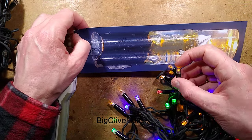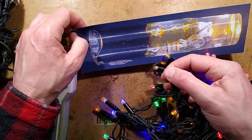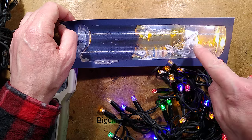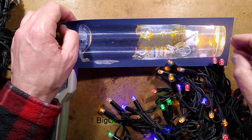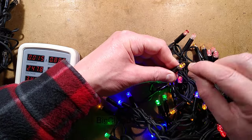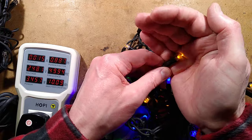In the early days they just had a domed cap, and the LEDs were standard domestic LEDs with the concave lens in the end that splatters light out in all directions. There was a problem with the curved dome — when they potted it, it caught a little bubble of air, and the light tended to shine out the end, making it very directional. With these newer ones, the plastic cup has a slightly concave lens so that even when you plunge the LED into the resin it still gives a wide-angle effect, and you can see the LED from all directions.